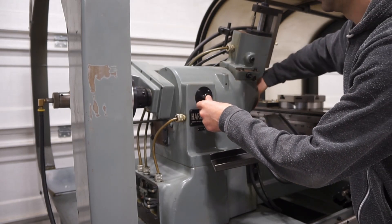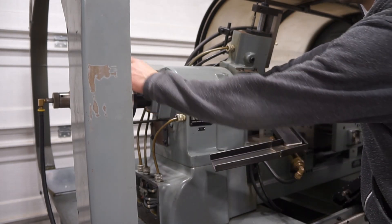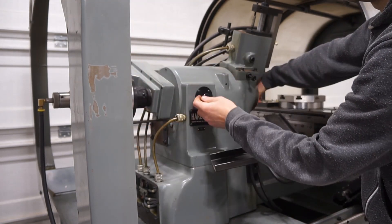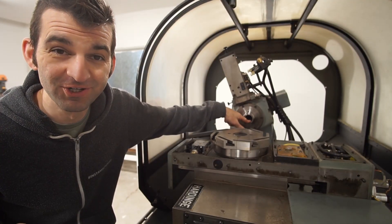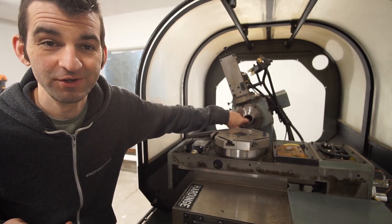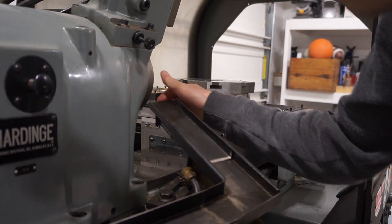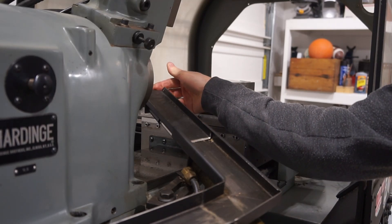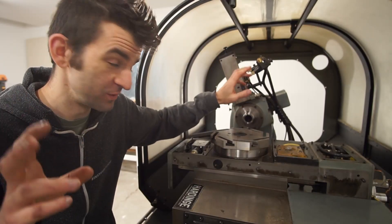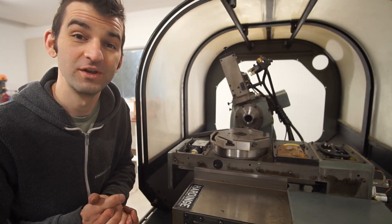The next thing to do is get all the flat belts and everything removed so I can spin this freely just on its headstock bearings. I'll put a dial indicator in here just to check. I don't even have a dial indicator accurate enough to measure any kind of perceived runout here, but we'll check it regardless because that seems like the thing to do. I'll put some weight on it and move it around to make sure there's no issues with the bearings. But just from hand feeling it — my super technical way of hand turning it — it feels very, very nice. So that's wonderful.